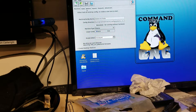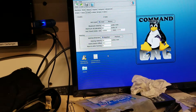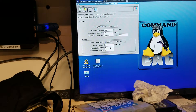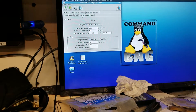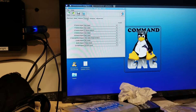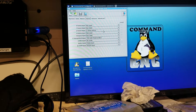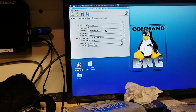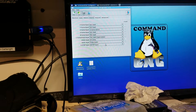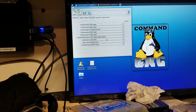Pretty much for the whole machine, you set your Z-axis up with your home switch offset, which is when it detects the home switch — it backs up off of it by that much, so you're not resting on the switch anymore, you're actually just floating off the material by about a piece of paper's width. He also helped me set up my inputs so that my probe and my Z home switch will work together — one's a backup for the other. In case the probe misses, the Z home switch is always going to be there to catch it, so I won't have as many missed homes or collisions. We also set up my limits input for all limits.